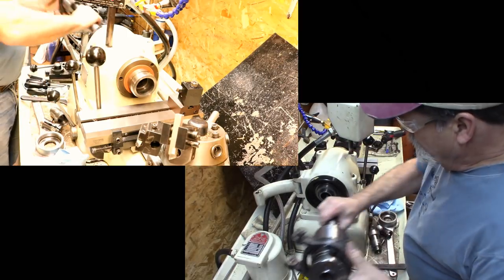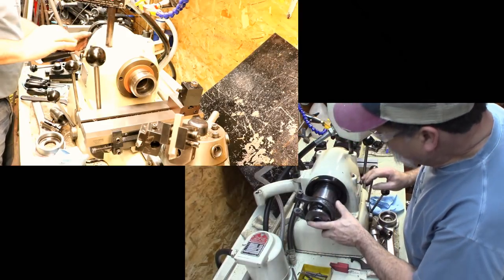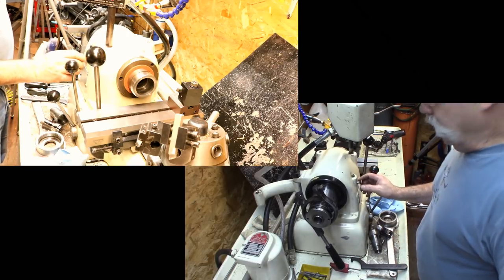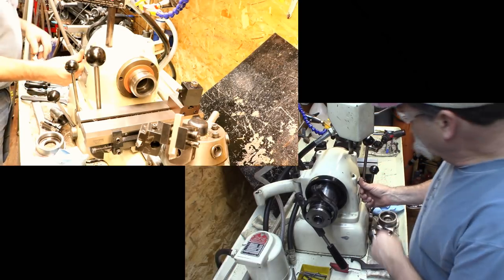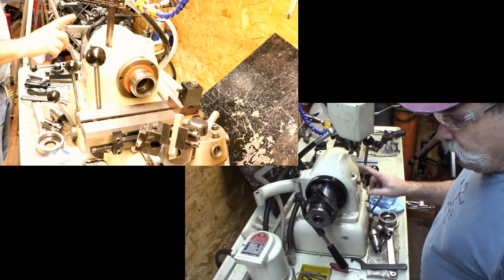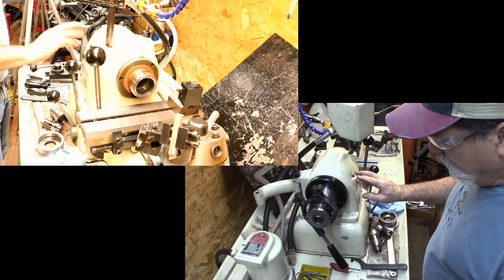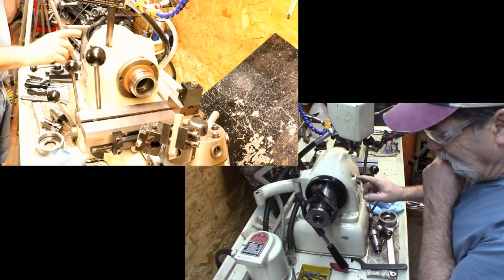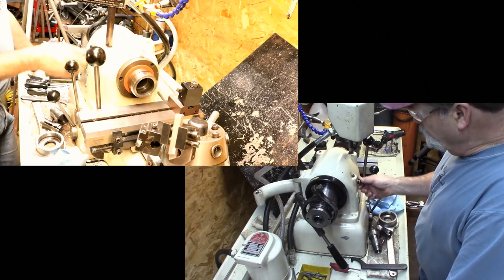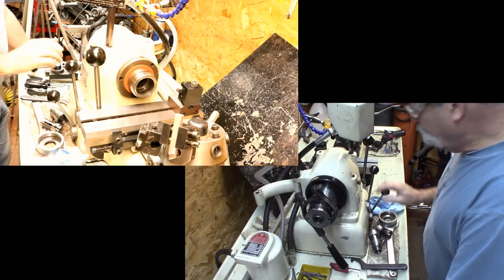So, the closer we just repaired slips in here. This lathe has a nice feature right here, and this is a spindle lock. So I have it in position here, and I'll push it in. And it opens a limit switch inside and disables the run mode, of course, the run controls of the lathe when you push it in. And you can have a set screw to lock it down if you want. We don't need to for right now.